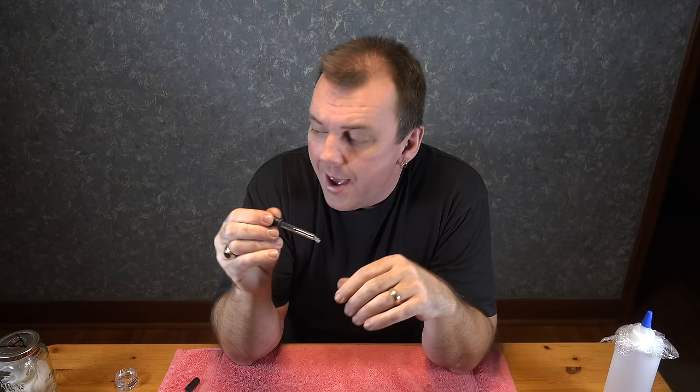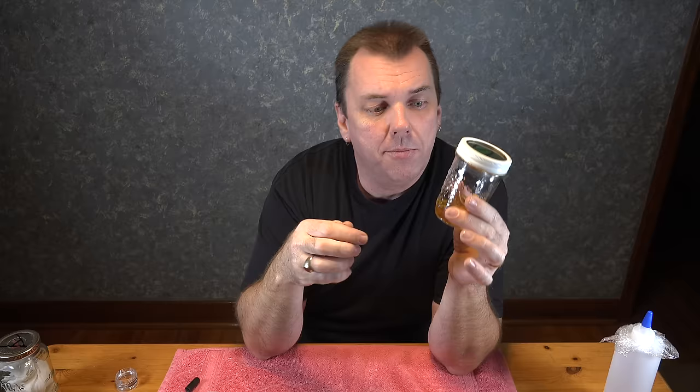The other issue that you may be having is if the rubber is a little larger, by dispensing shellac and dispensing alcohol from a bottle like this, you may find that you're getting too much onto your rubber and you're getting a buildup that you don't want. Remember, this is supposed to be thin, thin layers. So a little bit of an asset or a help is one of these medicine droppers. And you can then dispense your shellac from a bottle just by picking up a dropperful, putting about 10 drops worth onto your pad, and then from the alcohol as well, another 10 drops of the alcohol, and away you go, therefore getting smaller layers or thinner layers onto your project, and you'll get a much better finish.